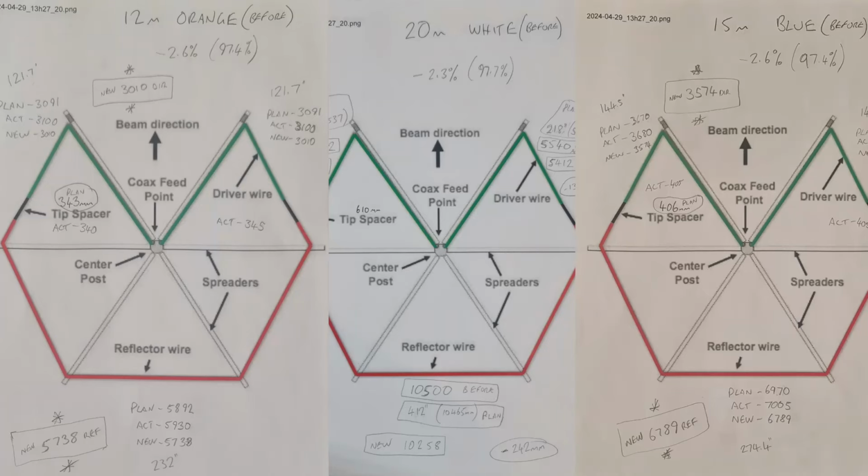But yeah, the wire worked really good. But from Leo's calculations, the wire was circa 2.1% shorter than the copper. So I had to basically just make a set, and then I had to remake a set. Some of them I was able to shorten, but the lower bands, the higher bands, the shorter wires, I actually had to make new ones. So probably took me an extra couple of hours, but hey ho, that's fine. That was a learning curve for me, and I've given you the data.